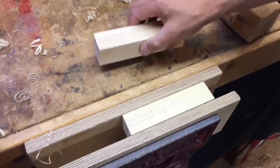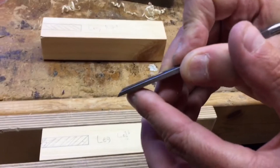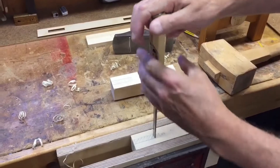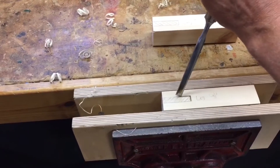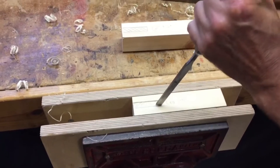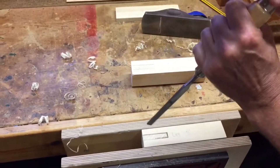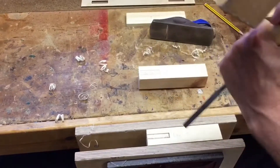Put your work very low in the vise, almost level with the vise jaws — those are the vise jaws in a woodworking vise. Then get a mallet and a chisel. Put the flat end there and gently tap it. If your wood moves, tighten the vise. Then very carefully try not to split your wood — just a little indent. I'm going to do this quite slowly because it's important you see this technique. Not too heavy — you'll snap your wood, and that's a very expensive mistake. Keep your chisel vertical.